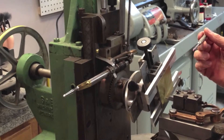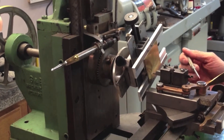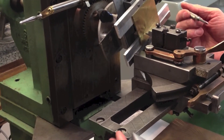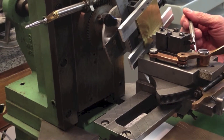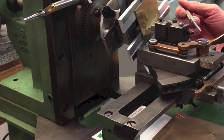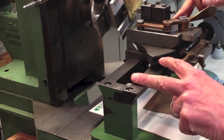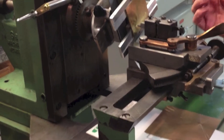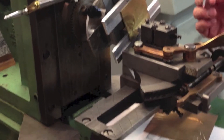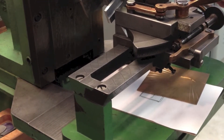This is a nice slide rest — interchangeable in verbiage with 'cross slide' — and it is from the 1940s. You can tell it's not cast like a lot of the ones we see in the older machines; this part is steel, this part is steel, and this part is cast. But it's nice nonetheless and it works very well. Just by the way it looks, you can tell it's not cast — it has that certain 1940s–1950s look.